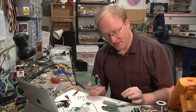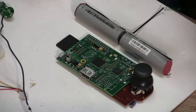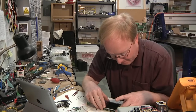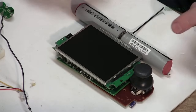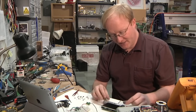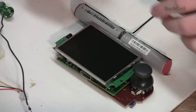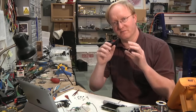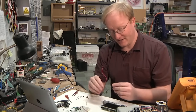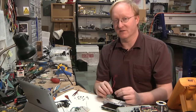Here's a configuration I think will work: we'll put the joystick right behind the Raspberry Pi, leave the HDMI in place so you can still use it, put a USB port here, and put the screen here. I took the battery pack apart to change its shape — there are two cells in it. If we put them out side by side, we can make the unit only this thick. If we had the cells together in a pack of two, it would be thicker. We also have to rewire the safety chip back onto the lithium pack — lithium batteries are very powerful, which means they can be dangerous, so take care when soldering them.